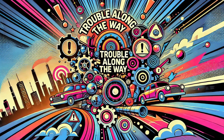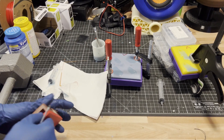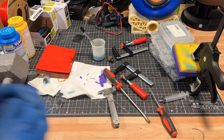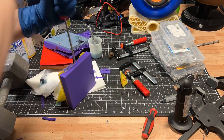This, however, was not the only issue on this build. I struggled with the molds and demolding as it was my first time using them. I failed to use the appropriate release agent, and it led to the molds locking themselves together with the layer lines. No amount of force, prying, beading, chiseling, or heating would break them loose. I ended up destroying the first set of molds completely without recovering the parts, making them a complete loss.